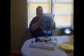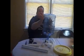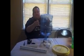I'm using an inch and a half pipe. If you have anything smaller than inch and a half draining into your beds and filters, you're probably going to have a lot of problems with it stopping up. I know I did — I thought three-quarters would be fine but it's not enough flow and not enough water going through it. I'm using a uniseal to fit into the sides, and it took a two and a half inch hole saw bit to drill the hole for the inch and a half pipe.